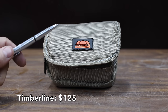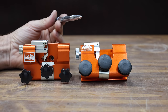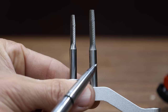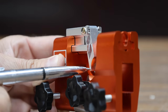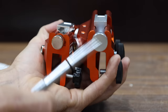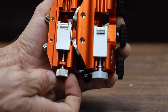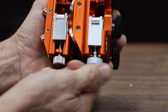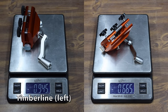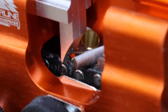At $125 is the Timberline brand chainsaw sharpener — a USA-made tool that the $30 Total brand is clearly a knockoff of, even copying the logo and user instructions. The Total's carbide sharpener is too small in diameter. The Timberline has a two-piece chain stop versus the knockoff's one piece, much larger and thicker thumb screws, larger knobs for better leverage, and correct clockwise-tightening on the chain stop screw — the knockoff loosens when turned clockwise. The Timberline has clearly superior build construction impacting durability, and weighs about 50% more than the knockoff.